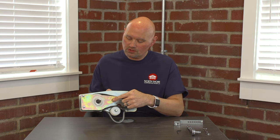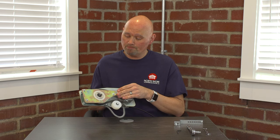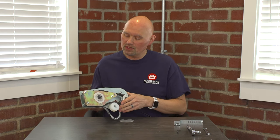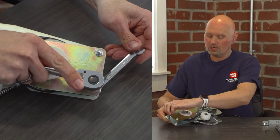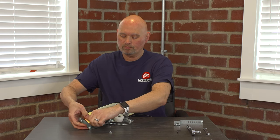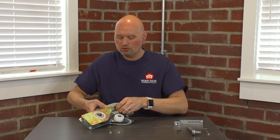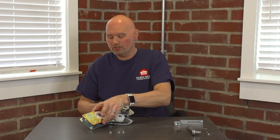On the one side with no motor, you have three 10 millimeter nuts. This is the same even on a medium duty unit. If it is an HP — high power — model, those have a couple more 10 millimeter nuts as it's a larger plate. I've already pre-loosened these with a 10 millimeter wrench and socket just for video purposes. Once you get those loosened, just remove the nuts.